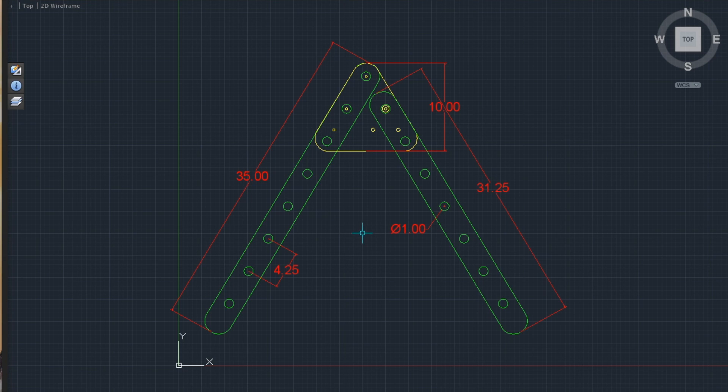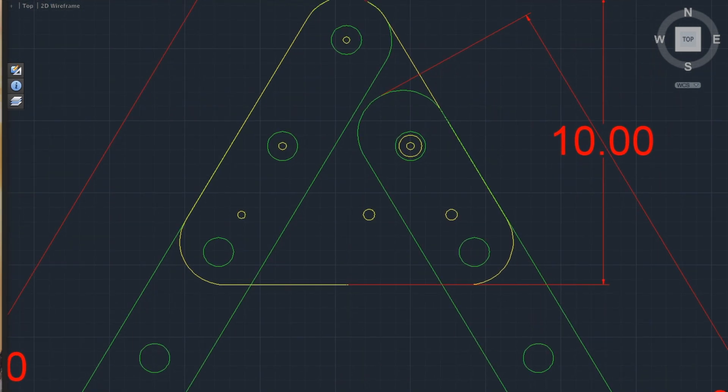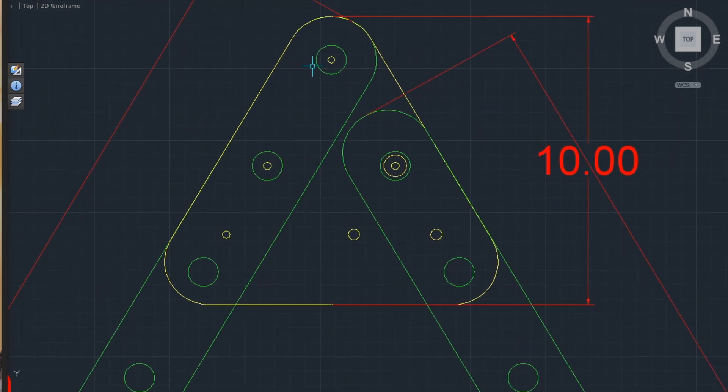There's a bunch of attachments you can make for it like ramps and things like that. There are three basic parts to it: you have the rails — one on the left and one on the right — you have the triangle which is the side bracing, and then you have the dowels which act as the steps. And if we zoom in a little bit, these are three screws that will attach the side panel to the long rail.